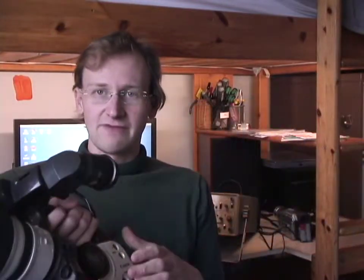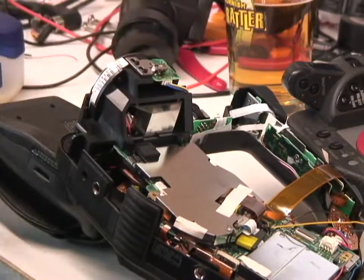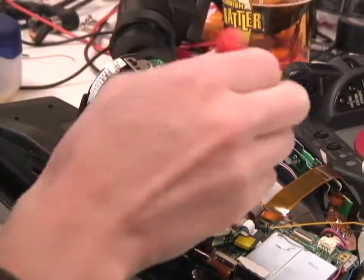On the camera's printed circuit board there's a test point which is designed specifically for you to hook an oscilloscope up to, to look at the output from the head amplifier. From that you should be able to see what the waveform looks like and use that to align the tape properly. We're just using the playback so we don't need the camera module in, so I'm going to remove that so I can easily access the board.